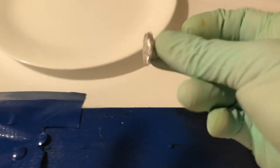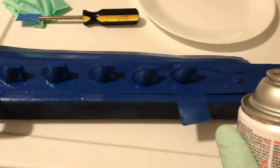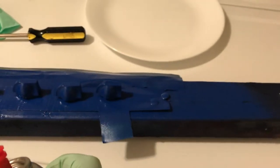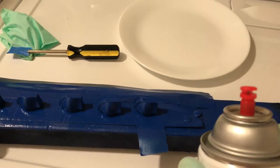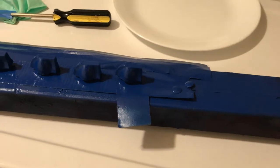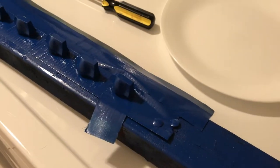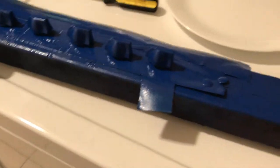They've been washed, cleaned, and mounted on the Hershey's Kiss elevators in a single file. For the first coat, I did a vertical sweep. Make sure your conditions are correct and read the directions on your can. My spray pattern is about eight inches across — you never start your spray pattern on your object or you'll get sagging and heaviness. Your spray pattern starts before the object and finishes after, about eight inches on each end. The first coat was a light coat.